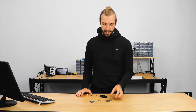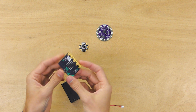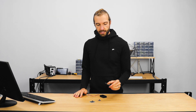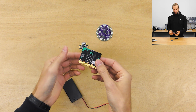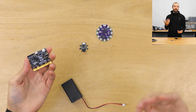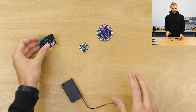The next one we're going to talk about is the micro:bit. It isn't something you usually think of when you think of a wearables board because it's not really in the wearables footprint, but it is in the wearables price range and capability space. The micro:bit has a lot of sensors built in: resistive touch sensitive pins, a couple of buttons, an LED array, temperature and light sensing, an accelerometer, a magnetometer, and Bluetooth and radio — all for a very low price.